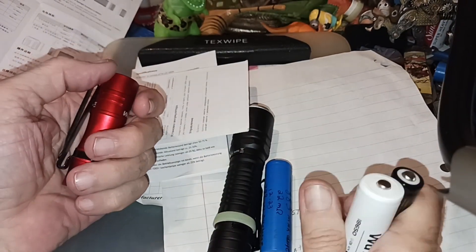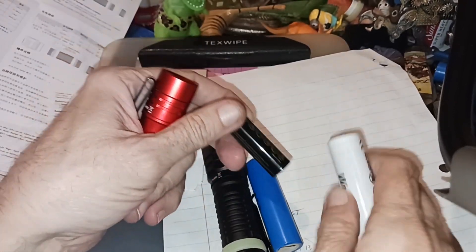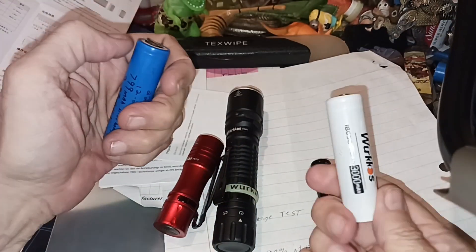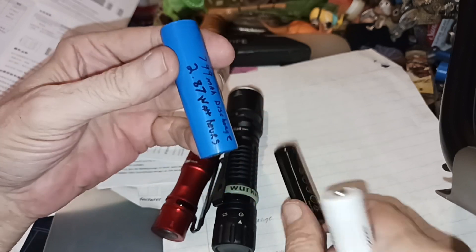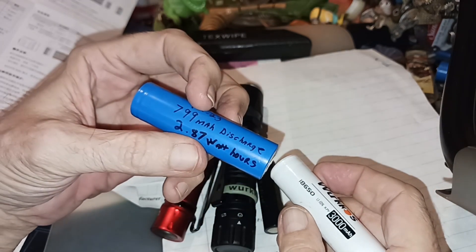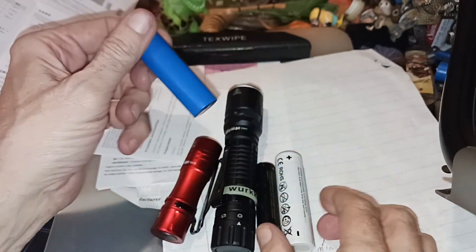Molicel and Samsung — if it's a real Samsung. A lot of those are just shrink-wrapped, and anybody can shrink-wrap something, so you have to get them from reputable dealers. If you go out with untested batteries you bought on sale for two or three dollars, you're actually getting one of these low-capacity cells when you're expecting a higher-capacity one. This particular battery was hidden inside a power bank, so they didn't even bother stamping any numbers on the outside.